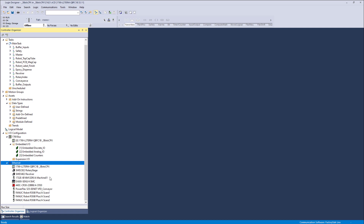By adding these devices as I/O configuration, you added them into the connection list that the processor has to deal with before it can go from program mode to run mode. It has to go through and resolve this to make sure everybody's there. If they're not there, you're going to get little yellow triangles in front of these entries — the processor cannot find the entities you said were there.